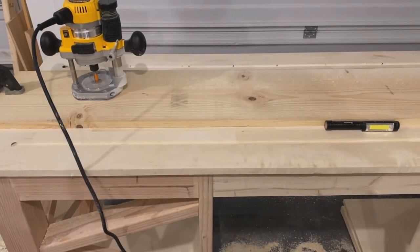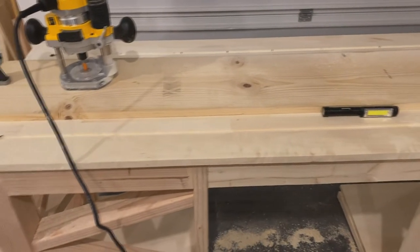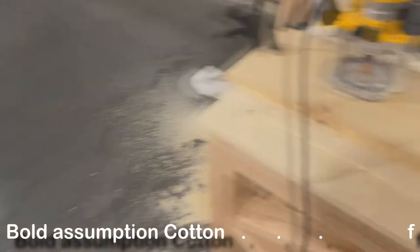I've never used epoxy resin before, so I've got a lot to learn. I'll probably have to practice with that stuff just like I did with this router, because I don't want to redo this again. I've used epoxy on my garage floor. You can see it here, that's why it's shiny. It's a different type of epoxy, but the same principle. You mix part A and part B together, and it's got a pot life and a cure time, and you mix pigment in just like I did here to get the metallic look. So that's the plan, just on a much smaller scale. I figure if I could cover an entire 3-car garage without messing it up too badly, I can do it with this.